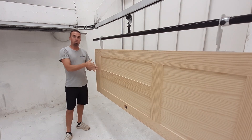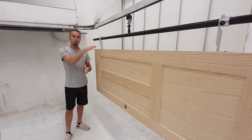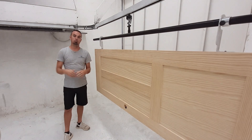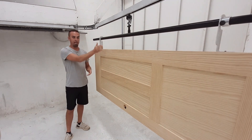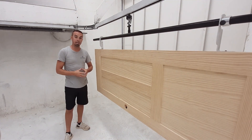It allows the door to stay at its original state, meaning you're not going to get any warping or bowing like you would if the door was to lay flat across sawhorses. The door can hang in this orientation until it's completely finished and dry, ready to take off.